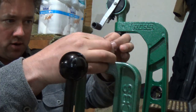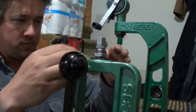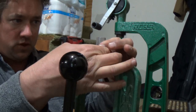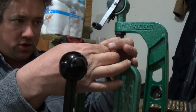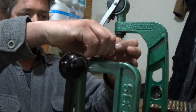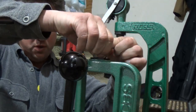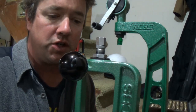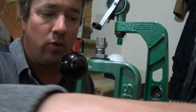It's basically just a trial and error thing. You just want to get just enough flare so it'll accept the bullet - you don't want to be beating up your brass more than necessary. Finger tighten the lock nut, then let's go ahead and get a fresh case and give it a run.